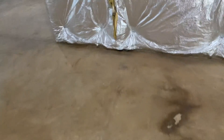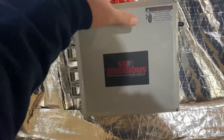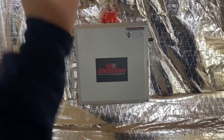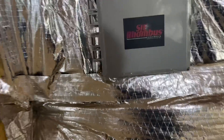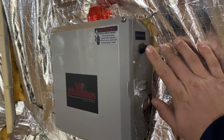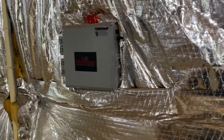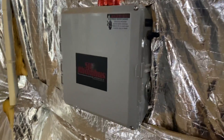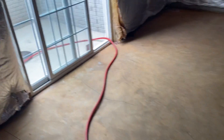We're going to look at the alarm inside the house. In our area, anytime you have a pump chamber for your septic you're going to want to have an alarm box just like this. This one is a nice big gray one with a light. Generally you'll see this style, the Myers style — a little tiny black box or a little gray box. Those are designed to go off whenever the pump is not working. Over here we'll have our button to test it or silence it. I'm going to press it in three, two, one — that's what it'll sound like when that float's up. When it comes time for that to happen, you just flick the switch towards silence to stop the alarm so you have time to get somebody over here to fix it.